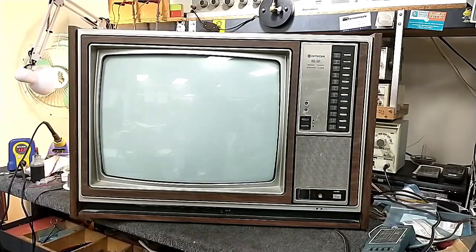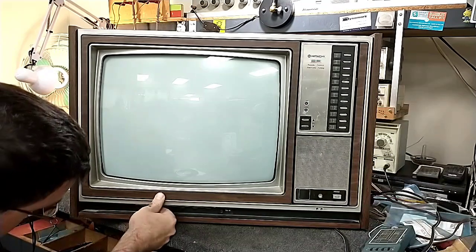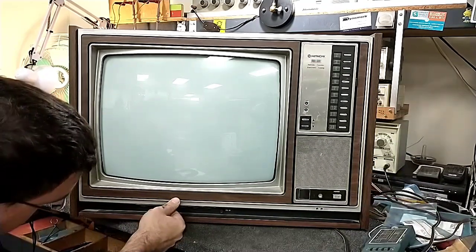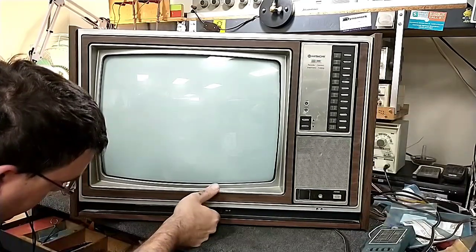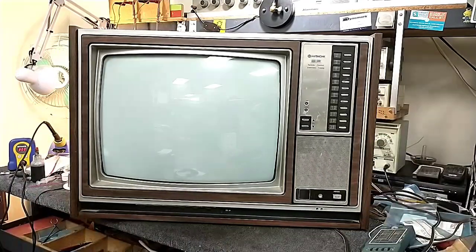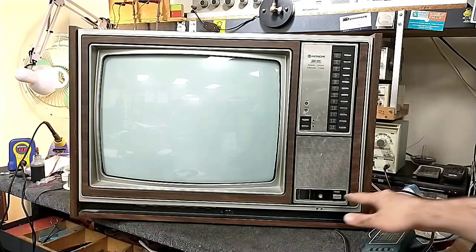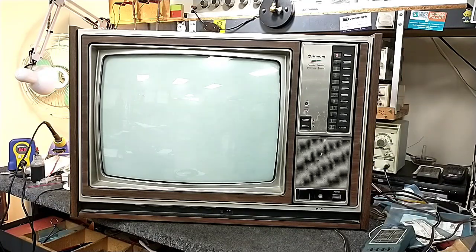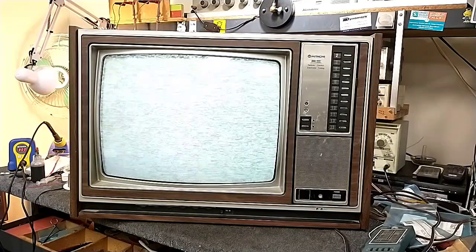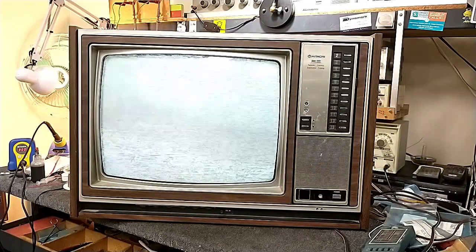Well, it's the big moment. Let me set all the controls to about midpoint — vertical hold, color, tint, brightness, and picture which is usually contrast. It's got the color lock and even VIR support, which you don't see very often on Hitachi sets, mostly GEs. Let's see if it flies or if it fries. It's a good sign — starting to come up. It's got a bit of a stain at the bottom left, but we have a raster. It's kind of a weak raster.